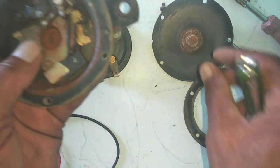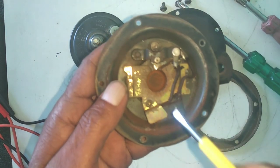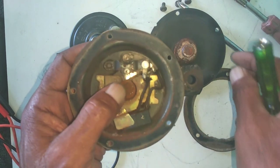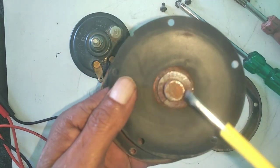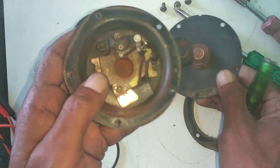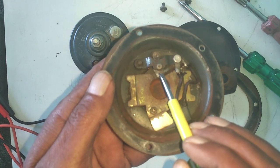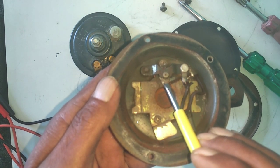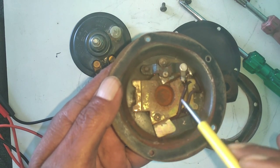The coil will become a magnet or an electromagnet. If it becomes energized, what will happen to the plunger? This plunger will pull it from inside. If it pulls it from inside, then this point — which is showing you the seat — this seat will be touched here. And when the plunger pulls it down, it gets disconnected and the current will be cut. As the current is cut, the plunger will be released.